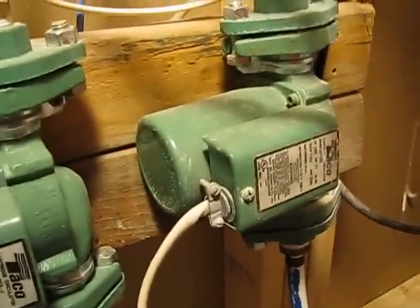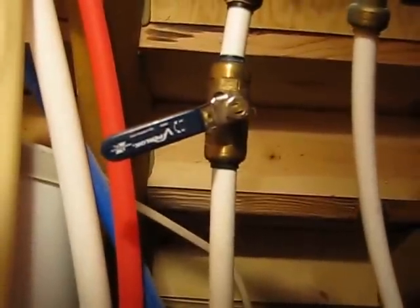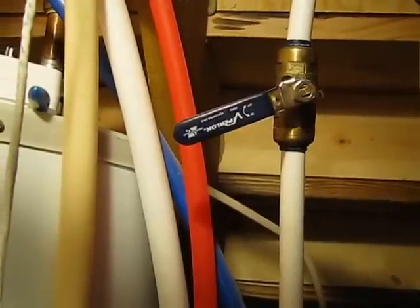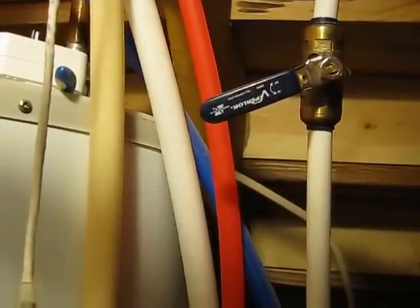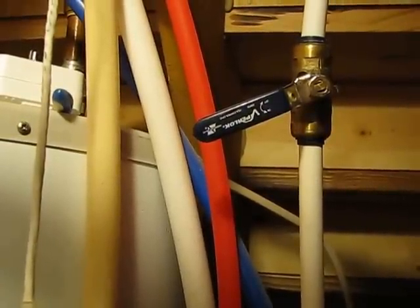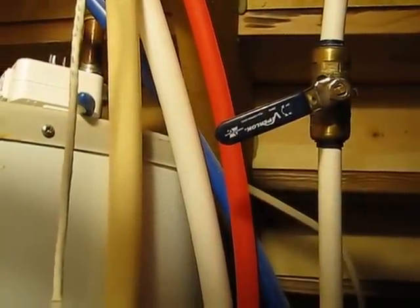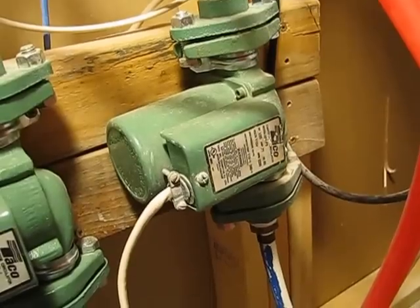Let's skip to number four — that's actually where that comes from. Number four comes over here; that's the cold side of the water heater. I actually have a valve on there and I control how fast I have the flow. I turned it down a little less than what the pump normally pumps. That way the water coming out of there is actually a little bit warmer — you can kind of adjust that to feel. I usually run it at night, so you could leave it full and it would just eventually heat the entire tank and get hot either way. I do this so that if during the day I'm taking a shower and I have that pump going on heating hot water, it's not going to cool my water down taking a shower, because that feeds directly to the hot side. So if it's cold, you won't have very hot water — that's why I have that turned down. That's the pump that feeds it.